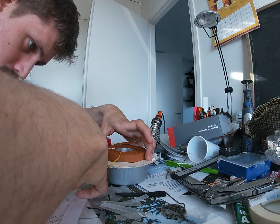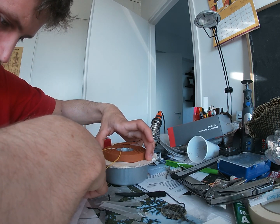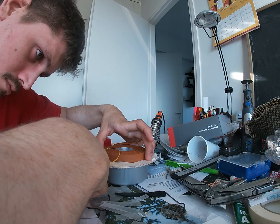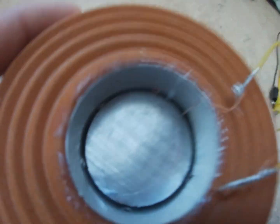The spiders were one of the only parts I didn't make myself. I tested placing the coil in the gap with the spider to find the best coil position where it does not rub the edges of the gap. Then I glued it carefully. I used a plywood ring as a platform for the spider.